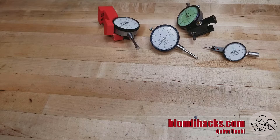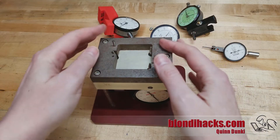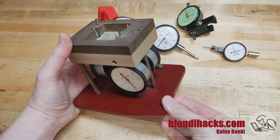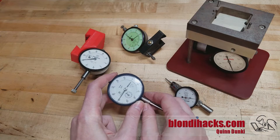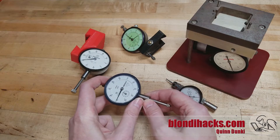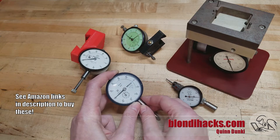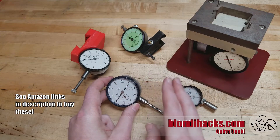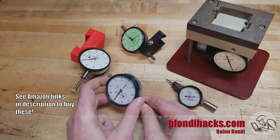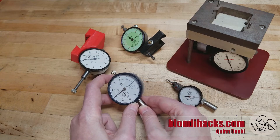Sometimes you'll see dial indicators incorporated into other tools and fixtures — for example, this flatness gauge has three dial indicators arranged in a triangle with a machine surface and registration pins. These are among the most high-precision things you will own, so treat them with respect. Don't drop them, don't get them dirty — treat them like a fine watch, because that's exactly what they are. They are expensive, but don't skimp on these — get high quality indicators. You can often get them second-hand for very reasonable money; all the ones shown here were purchased on eBay and in several cases refurbished. Much like fine watches, quality indicators can be taken apart and serviced, and you can do that yourself or send them away.